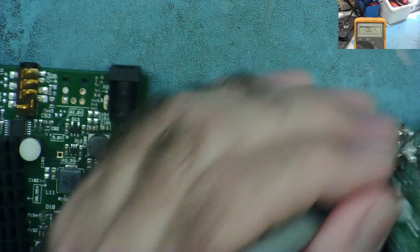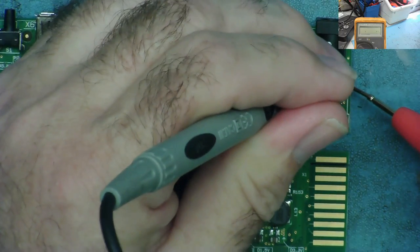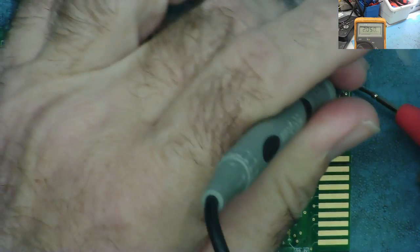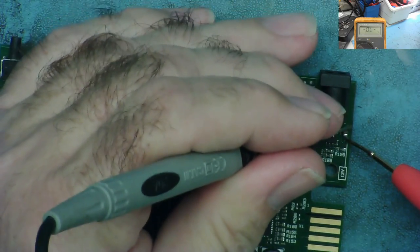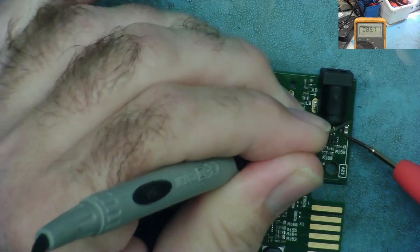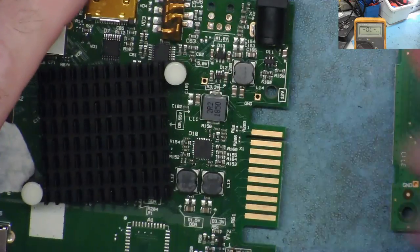And this one, although this is a faulty one, all the voltages are there. Yeah, and this one's reading like much. I mean, that is actually reading in mega ohms, 2 mega ohms. Whereas this one is reading 90 ohms. 85 now, so it kind of varies, and that's a bit strange. That's not right, and I'll show you why.